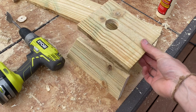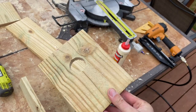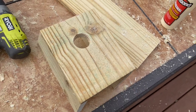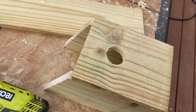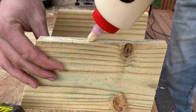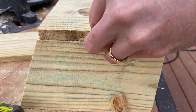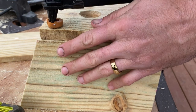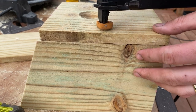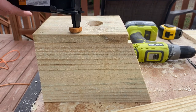Hook up the air gun — we're going to use brad nails and wood glue to connect the pieces, though screws or tack nails work too. Take the front piece, decide which side looks best facing out, and lay it on top of the two side pieces. The bottom should be flush, but there will be a gap at the top — that's intentional, to allow ventilation for the birds. Put standard wood glue on the fronts of the side pieces, then pop a few nails in — about four per side. Make sure you're going straight so nails don't come out the side or inside of the box.